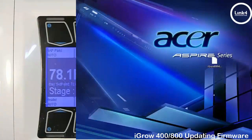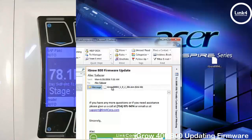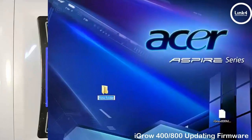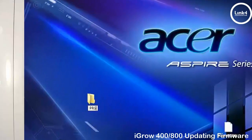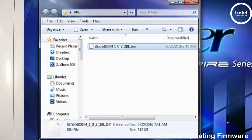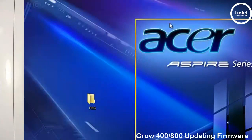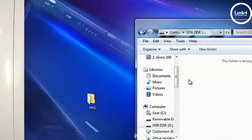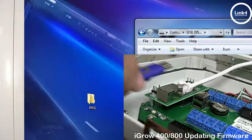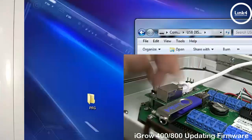Another way is to call support and we can email you your firmware file. Just place it on the desktop when you get it. Once you have the file, you will need a USB — preferably one that's been reformatted, empty, or even new. Open the USB and create a folder named PRG. Insert your bin file into the PRG folder. The file must be in the PRG folder in order for the controller to recognize the firmware update process you're initiating. Once confirmed, pull the USB from the PC and insert it into the USB port on the controller farthest away from the back side of the control board.